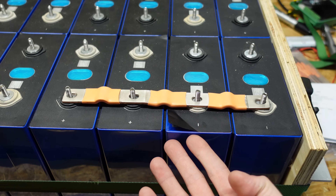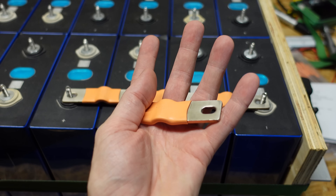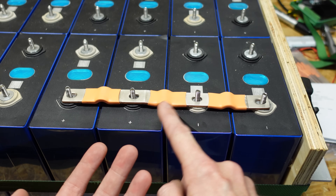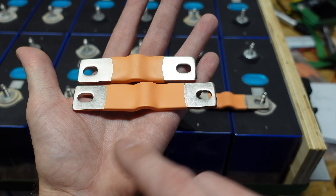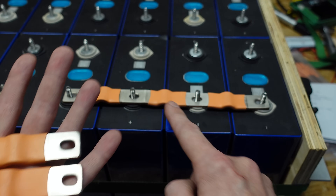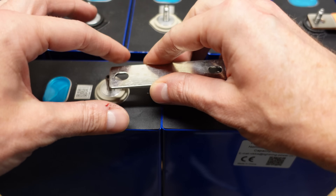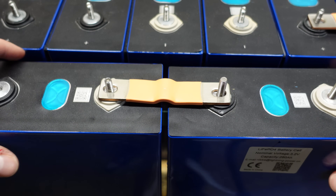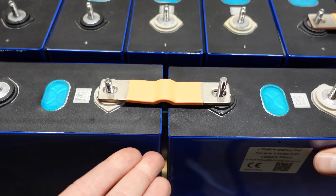You may be saying: I've got some cells that are slightly thicker or bloated, and this bus bar just doesn't fit because the cells are so bloated you can't fit it between the two terminals. Well, that's not a problem either, because they also make a longer version that is 84 millimeters from center to center of the terminals. So even if your cells are super bloated apart, you can get this 84 millimeter bus bar and fit it between them. The 84 millimeter version also allows you to do the snake-like orientation if you want to line them up end to end instead of side to side.